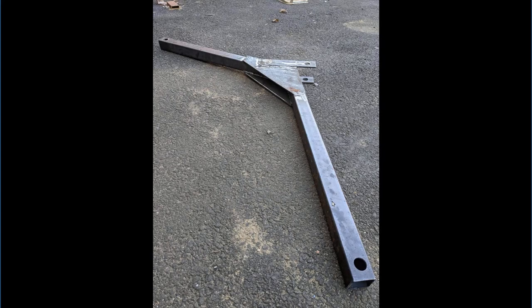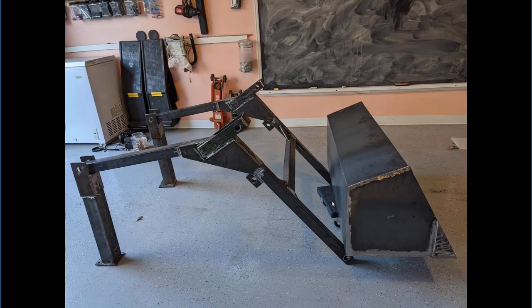One thing to note is that any little bit you're off with those holes will have a consequence. I had some fiddling to do — I drilled the holes first on the flat bar, and when I welded it on it wasn't quite right, so I ended up having to use a die grinder to grind that out before final fit-up. Here we have the boom arms all final welded, and these are the pieces I've done so far.